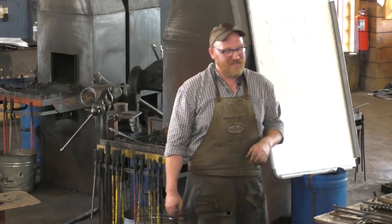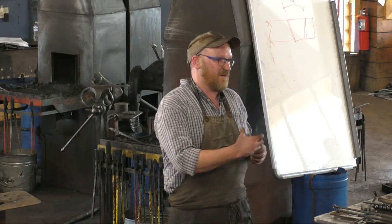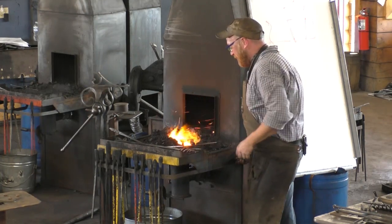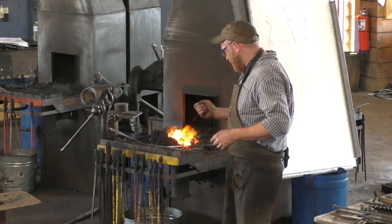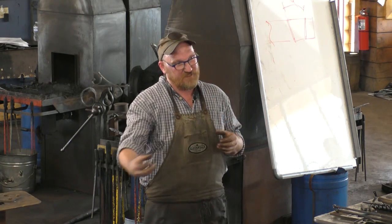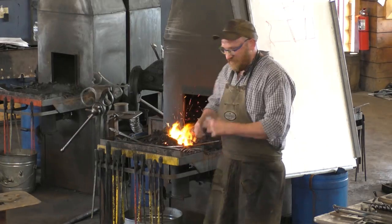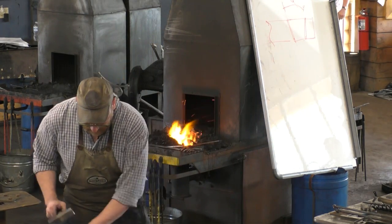Chisel off one side. Well, what I'm actually going to do is stretch the back of it because I want it higher up the hook. I don't know if the one that's gone around has gone around, but it's fairly high up. There's only like an eighth of an inch there, but I need it higher up the hook to allow for it to slide down enough for clearance. So first thing we'll do is stretch the back, and then we'll clean up the lips, or the fold-arounds, if you want, or if I want.